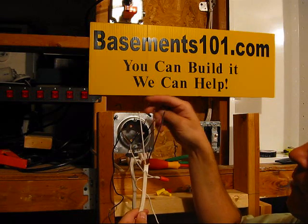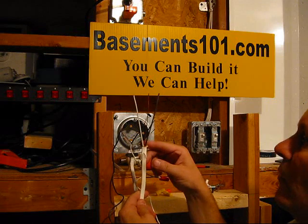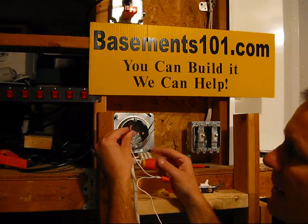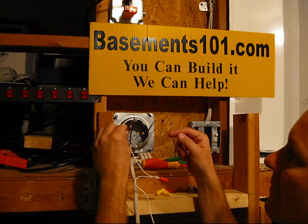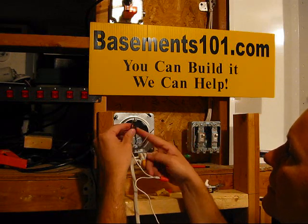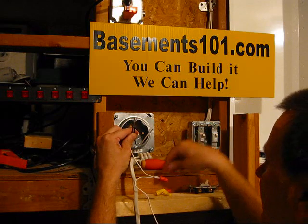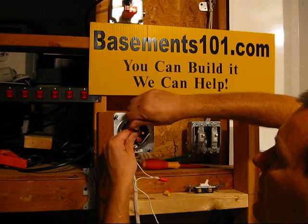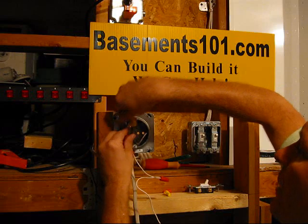This is the original black colored wire that comes in from the breaker box — this is my hot wire, and it was connected to the light. What we're going to do is disconnect that and take the same black wire going out to the switch now. We're going to take the new piece of Romex and connect the two colored wires together — black, red, whatever colored wire you've got.